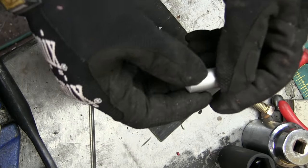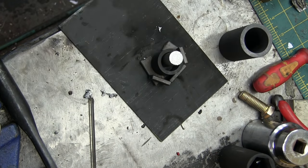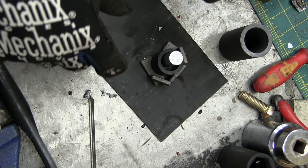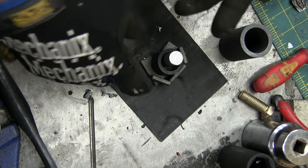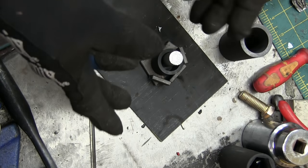Here's some aluminum billet from the hardware store. It's just cheap crap, but it's gonna do the trick. So we put it in our graphite crucible. Now I have a graphite base — you can buy that on eBay too, you don't really need it. And also these are just graphite gouging electrodes that are broken up and made into a little shield.